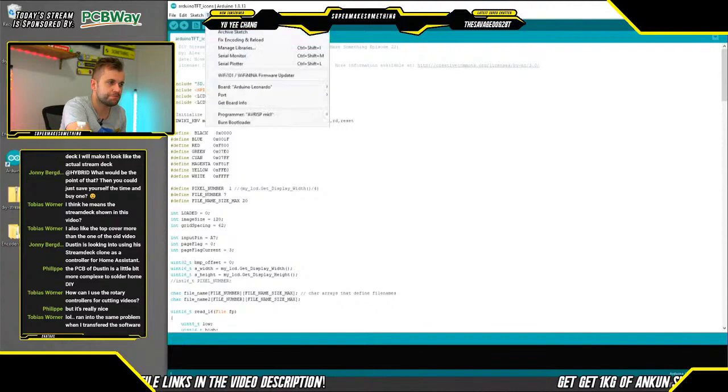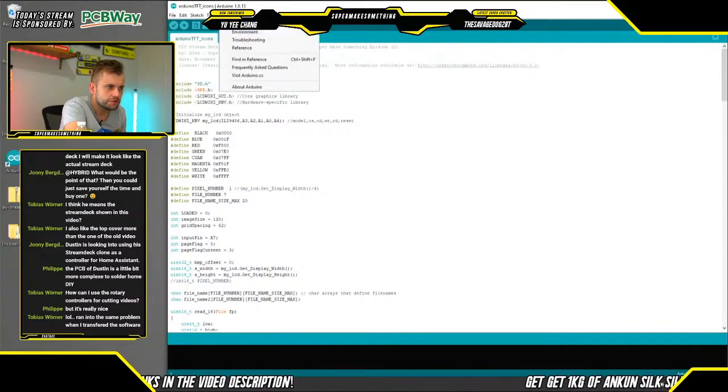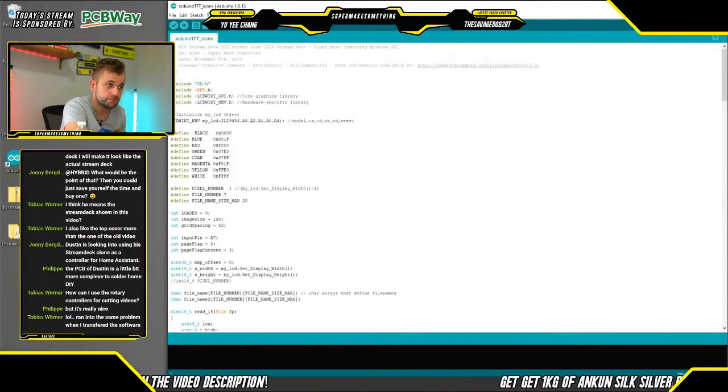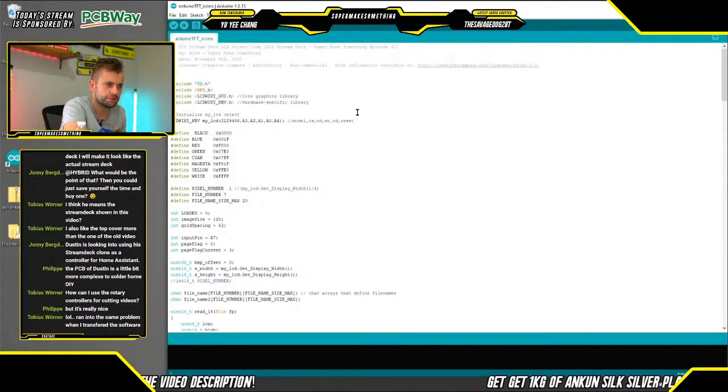So, okay, to program this, we are going to go to Arduino, we are going to go to Arduino Nano. We're going to go to Tools and Processor. We're going to go to ATmega328P Old Bootloader. And we're going to go to COM port 6.